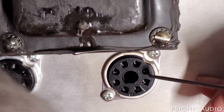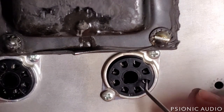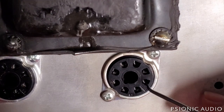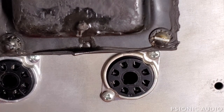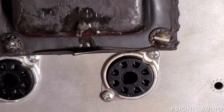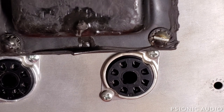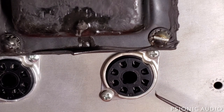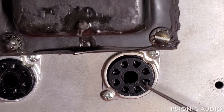It's a little bit tedious. You don't want to bend them too much because you can deform them — if the pin is too small, it will just crush the cup and you'll have a bad socket. After I do this, I'll flush them with isopropyl alcohol a few times to ensure good contact between the metal pins on the tubes and these metal receiver cups.